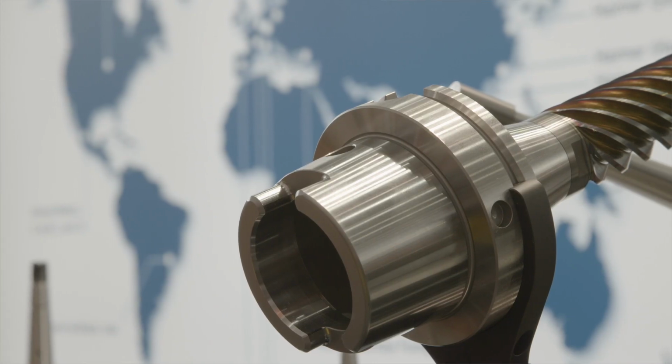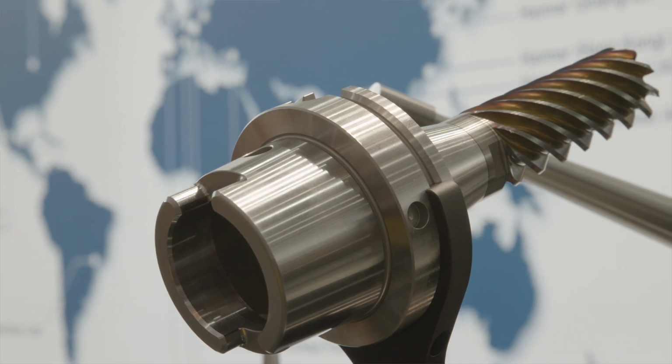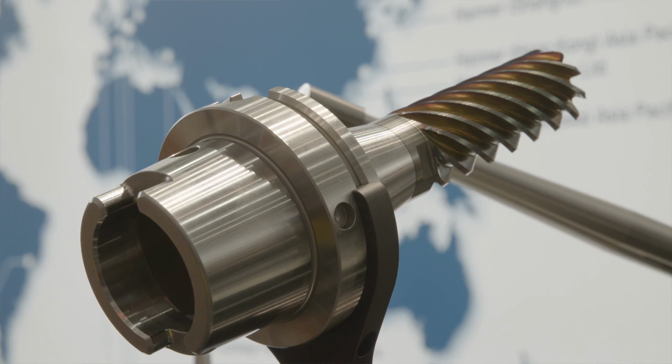Yeah, this is really an addition to the range now. So we have 3xD, 32 diameter. This is a typical aerospace type application. So we've really expanded the portfolio on the Duolock heads. And the Duolock, a lot of people have a twin point location. I believe Duolock is 3. Yeah, we have 3-point location. It's extremely accurate, extremely stiff system, and we can really slot a 1x diameter.